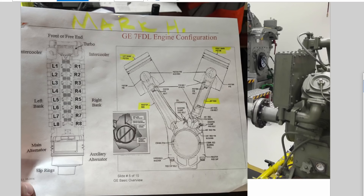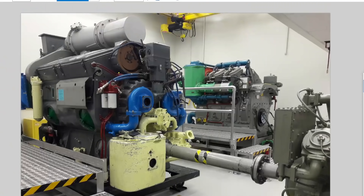The key point is that unlike a car, where each connecting rod connects to its own bearing on the crankshaft, these locomotive pistons actually share bearing sets. On GE they're labeled left and right, positions one through eight. On EMDs they're labeled one through sixteen, so pairs like number one and number nine are next to each other and share their crankshaft bearing. That was a quick crash course at level two — what does a diesel engine in a diesel locomotive look like? This is already quite complicated at level two, but we're dealing with a more complicated machine than a steam locomotive.